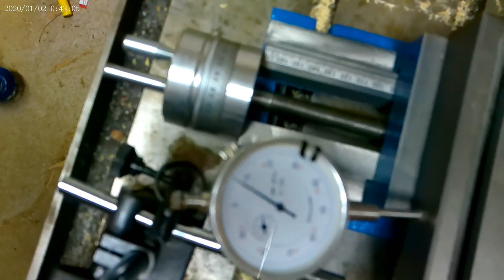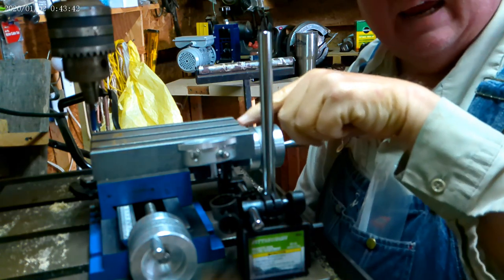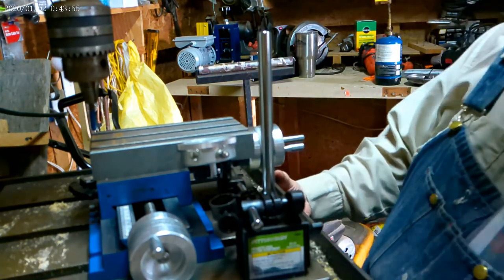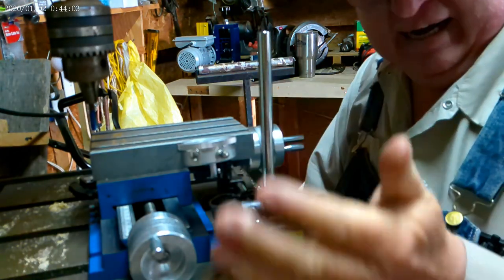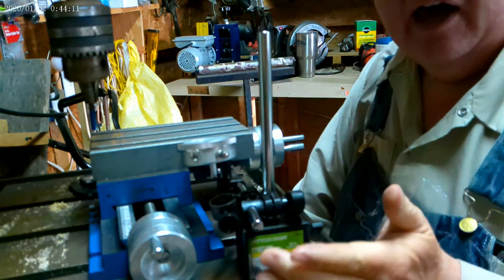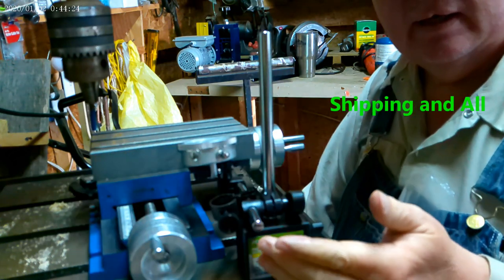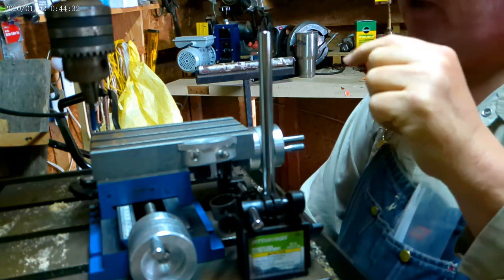You'll have to adapt for the play in doing your work, but you will not be able to use this as a stop or to gauge how far to go. You're going to have to actually put a mark on your material or something. As it travels this way and that way, there's no variance in the dial indicator — it's not moving in or out. So it's pretty well machined to stay on a good straight path. As far as in and out from this side, I put the dial indicator over there too and it's the same. It's good and solid about the travel — stays within a thousandth. That's pretty doggone good for a table that cost $89.